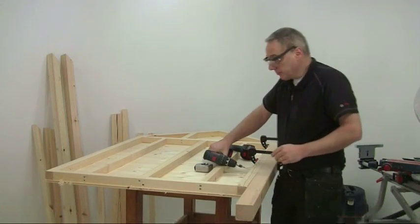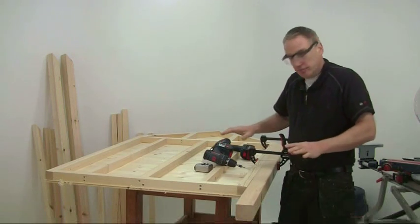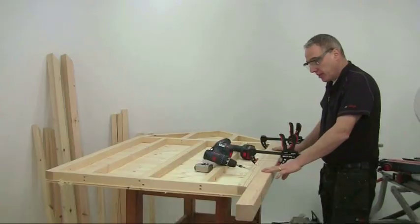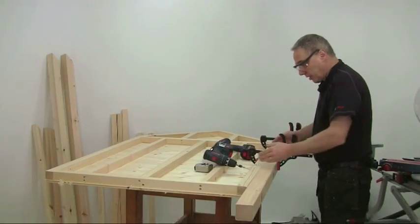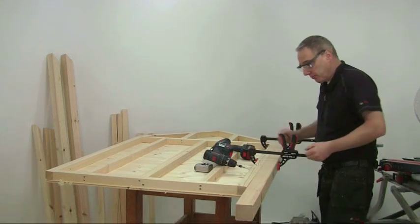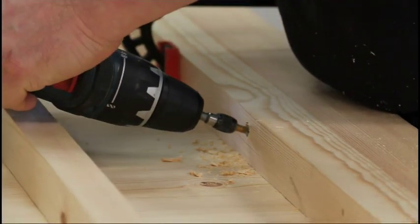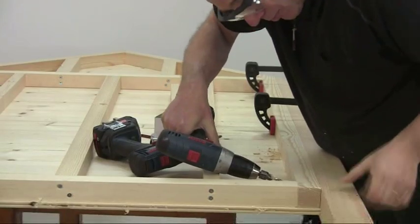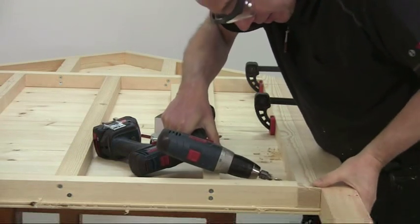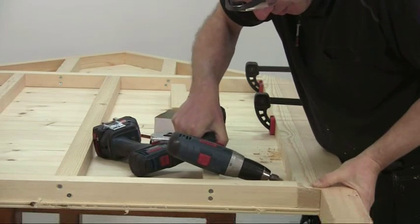This isn't the easiest job - it's all getting a little bit heavy. I decided the easiest way was to put each section onto the bench and then clamp the legs on the side. I'm going to drill and screw through, putting four screws down the length of each section - that should give plenty of support and get it all nice and rigid. I'll put these at a slight angle because of the internal frame, but we've got plenty of meat in the legs so that should be no problem.